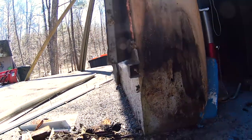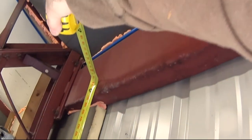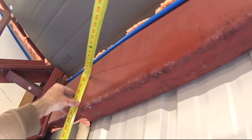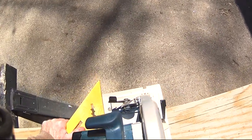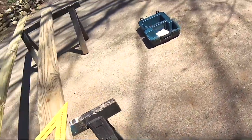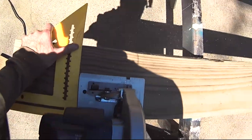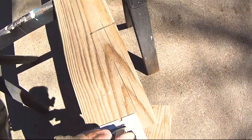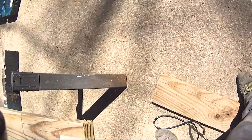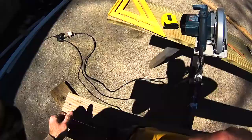As you can see, there's no actual wood really left there, so I'm going to have to replace these. I'm replacing both the king and the jack studs with PT lumber, just to reduce the chance of that happening again. I'm creating a notch to go around that steel header beam that's in place, so I have some meat up there that I can bolt the torsion spring to.